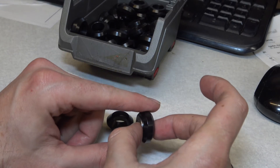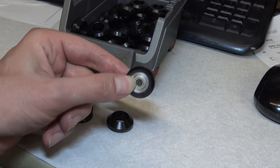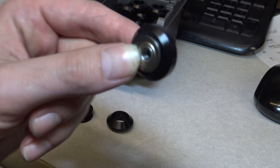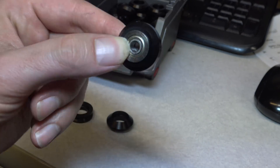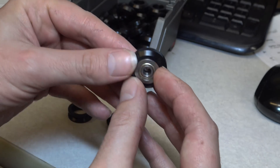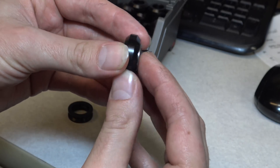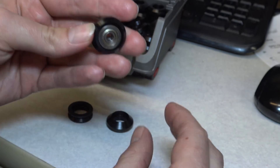We're about to make some of these Delrin wheels. This one is the Sutherland wheel — my buddy Greg Sutherland designed this one. Basically the way it works is instead of a counterbore hole, it's just a flange bearing — a through hole 14mm — and a flange bearing goes in there.